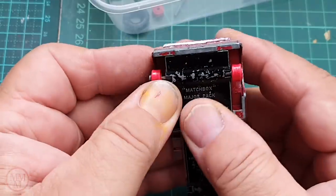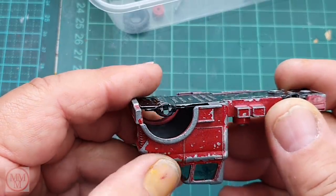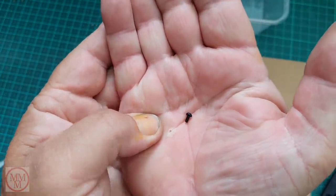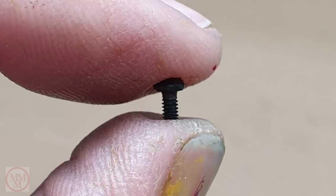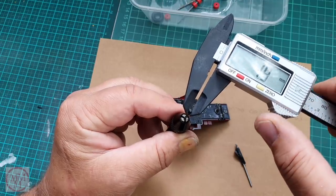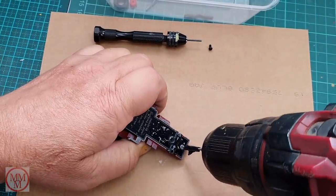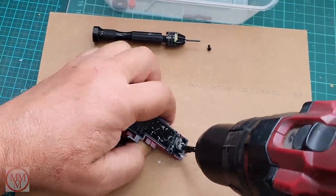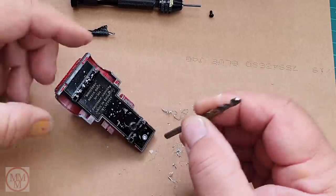Now the front — quite a simple operation. I've gained enough confidence over the last couple of years that I now just hold it in my hand. I'm going to drill the rivet out at the back and put this thing back together with a tiny M2 screw. The threaded portion measures 1.9mm on my micrometer, so I'm going to drill the hole with a 1.5mm drill — this will leave enough material in the hole to cut a screw thread. If I used a bigger drill I wouldn't be able to use that screw — I'd have to glue it.